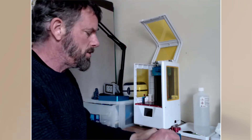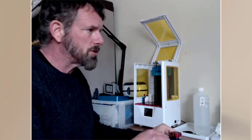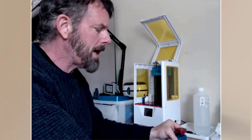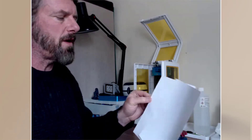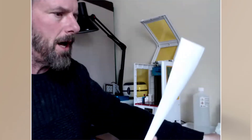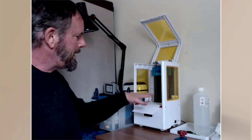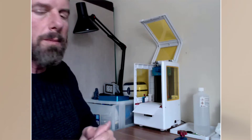Mine's already set up — yours might be loose — but we need to use one of the little allen keys to loosen the small screw inside here. That's going to let this whole unit move freely. We also need some photocopier paper, just thin paper. I have two sheets — an A4 sheet cut in half — and I'm going to lay that in here ready for us.